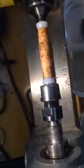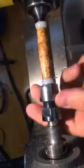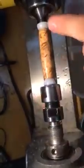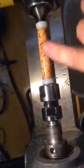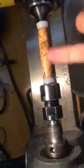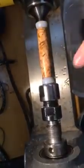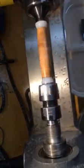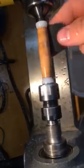One thing that I do is I'll dry my blank off with my finger until it is completely dry. You'll see it's basically dull now, and all the little scratches or cracks, the little marks that you want to get rid of, will shine because that's the CA that hasn't been touched. So I've got a couple here, here, and here, so I will go back and I'll wet sand some more.